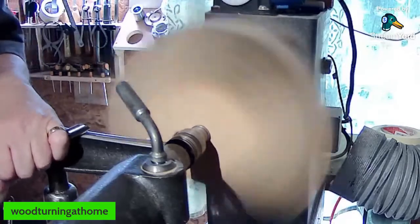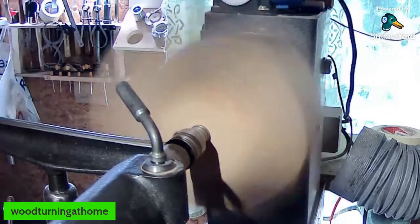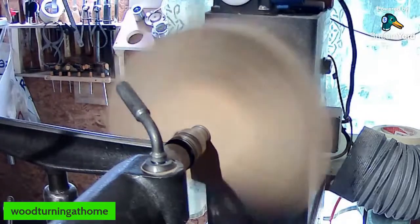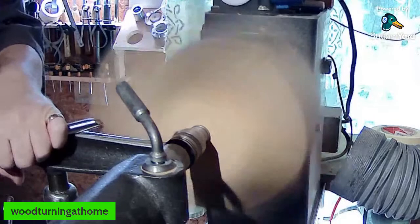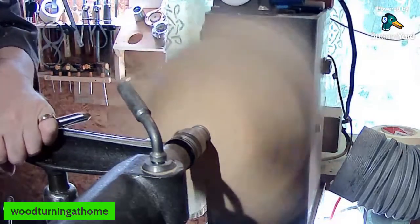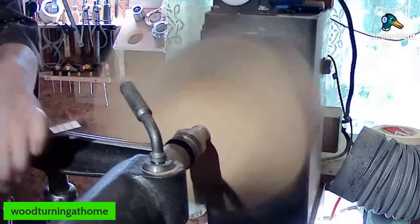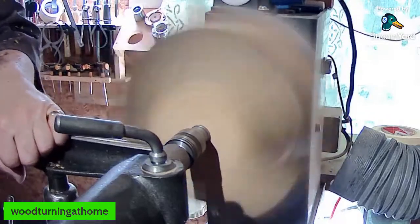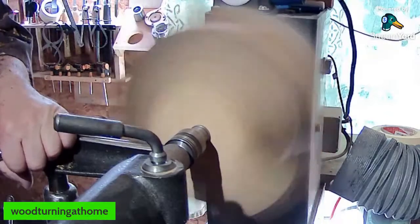Brian will tell me who's in and any questions. Mark Beckett had a near miss the other day. Terry almost had one last night — his piece was a bit cracked and not very well held together. So a face shield is always good, particularly when you're roughing out. Once you've got your piece into round and it looks sound enough, it's up to you after that.